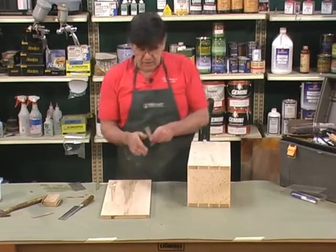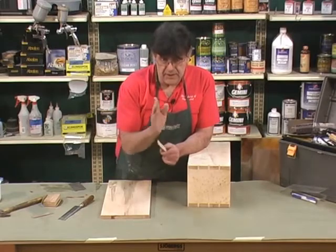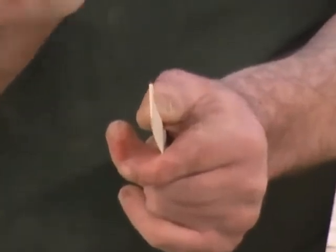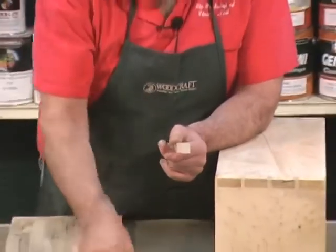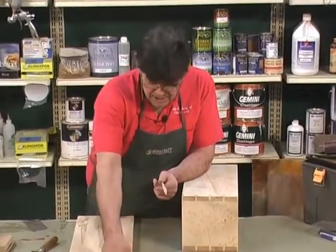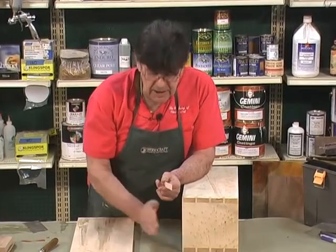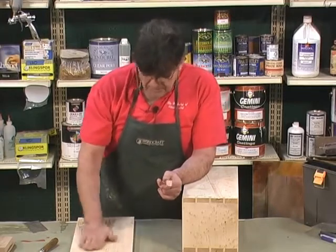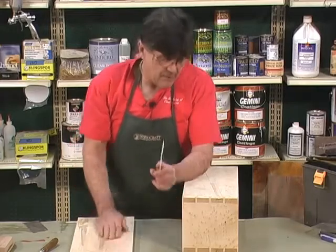Now here's another thing you can do if you need something larger. What I did on this is I simply set my saw blade on about a 5 degree angle, depending upon what you need. What I want to do is make a knife blade. And I cut it on an angle, just taking the edge off. Then I set my blade back straight, came in right to a fine edge and cut it again. Again, cutting to the left side of the blade to where this just falls away. And it's a lot safer to use something that's a little bigger to do that with.